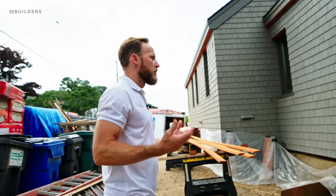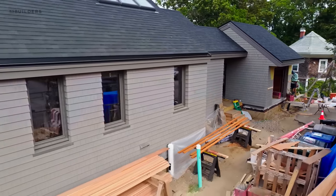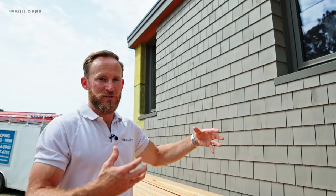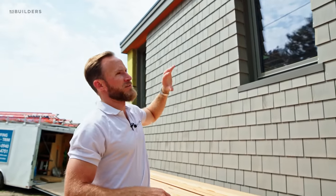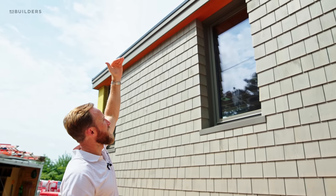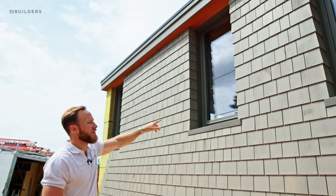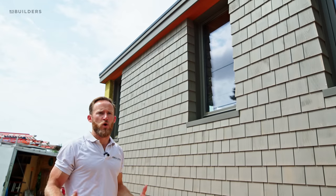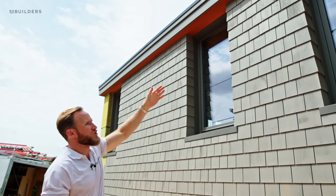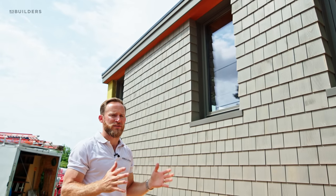The woven corners are a really nice traditional detail that plays well with the traditional shingle siding on this house. But we're mixing that with more modern details — these windows. Traditionally you'd have casing and windowsill jambs, but we don't have that here. Julia's done a great job: the soffit dies right into the head of the window, so there's no siding above the windows. The window goes all the way up to the soffit detail. You can see the overhang on the front — only about six inches — but you get that deep pocket at each window bay. The windows are also set back because of our wall assembly and the additional six inches of exterior insulation.